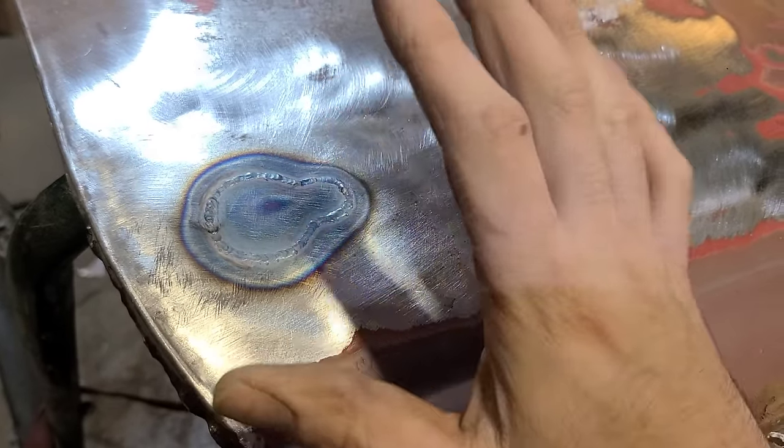Depending on how the cab is chopped, I may also have to slice these doors right in here and just tilt them in a little bit to get everything lined up. I do know that I have to for sure widen the back of the roof when the roof comes down, so that could possibly change the geometry here. If I do have to do that, then I'm going to have to change the geometry of the inner window tracks. Again, it's a lot easier to get that sorted out with the skin off, because what we don't want is the glass to come up like this and then have to make a bend like that, because glass doesn't bend like that. So we need the channel for the glass to be all one straight shot all the way through.